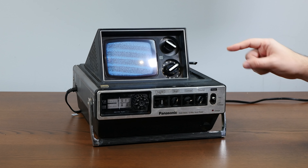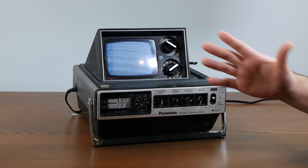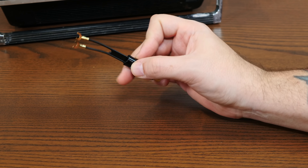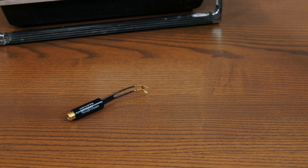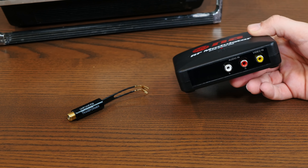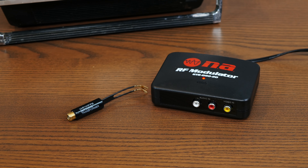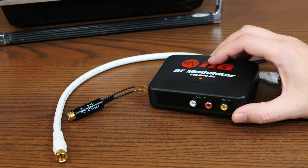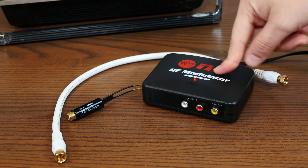The only input is RF — those two little screws. So to get composite video into it, we need to go through a few different devices. First is a VHF transformer, which gets us from the two little screws into coaxial. And then the coolest part: we have an RF modulator, which is basically a VHF TV station in a little box with a signal so weak that it really only goes through a wire. Although if you get close enough to the screws, it will start tuning into the station that it's outputting, which is pretty neat.